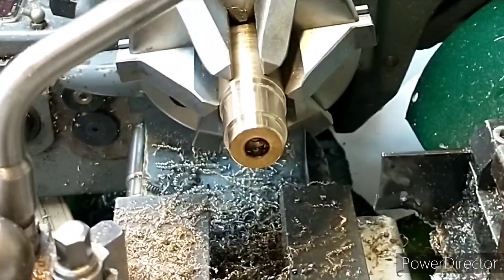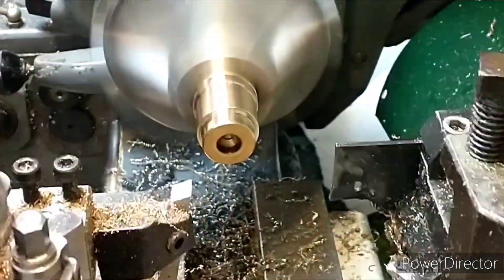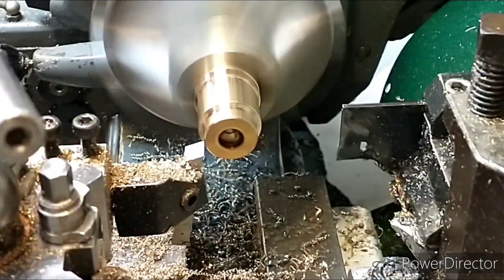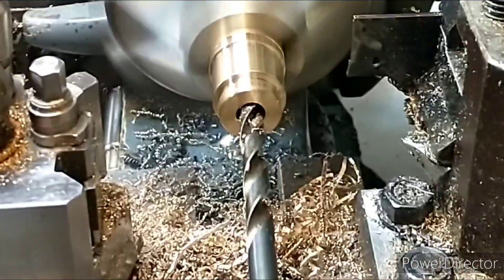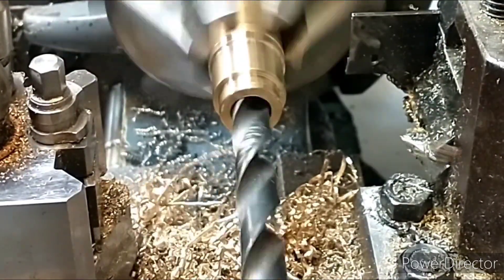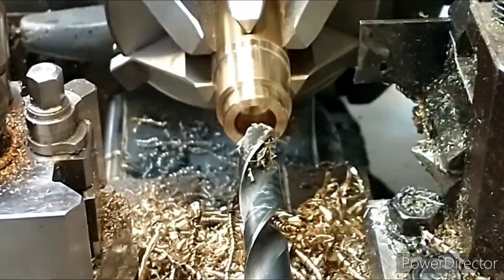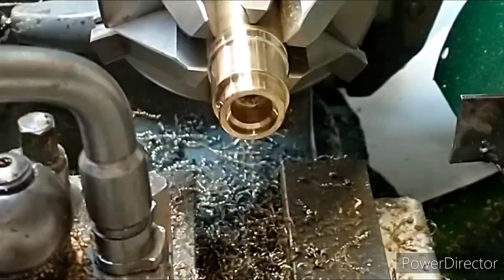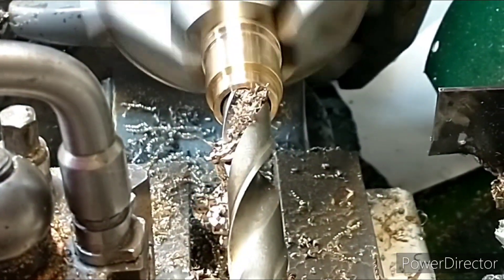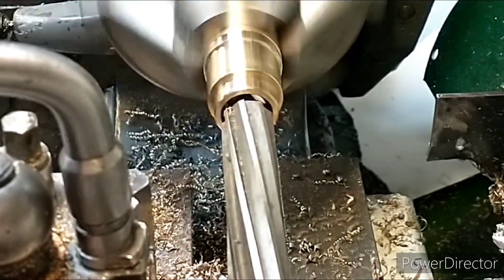You can see I'm offering up the connecting rod just so it's a nice fit, and I'm using that then as a gauge just to get the length of the bush just right, so it just protrudes through about 0.1 of a millimetre. Then finally we're going in with the drills - I think it went off a bit there so I used a boring bar just to get us back concentric. You should see us trying the 16mm reamer, but this wasn't in great condition so it cut undersize.